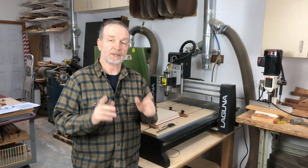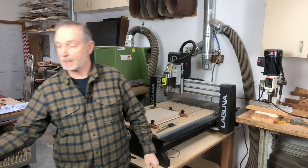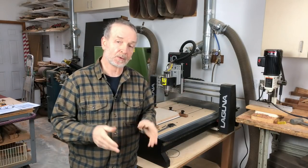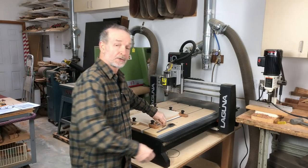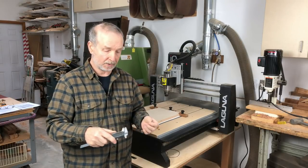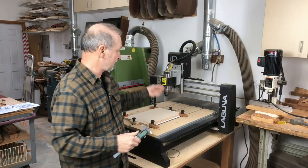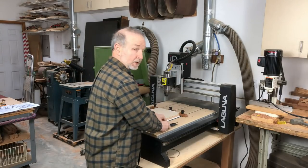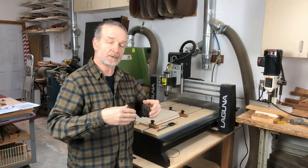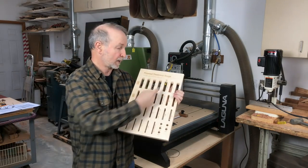Before we get started I want to encourage you to do something first. In order for the thickness gauge openings to be accurate, you have to make sure your bit is accurate too. For all these cuts you need to use a quarter inch spiral bit — I prefer a compression bit so the top and bottom of the plywood won't be torn up. I've never run into a quarter inch bit that was exactly .250 inches wide. Get a very good caliper or better yet a micrometer and measure the actual cutting diameter of the bit you're about to use. For example, the bit chucked in right now is .243 inches in diameter — this one's .2435. Put that value into your CAM software so the CNC is cutting with .243 or .244 or whatever you end up with, so that the openings are exactly as stated.